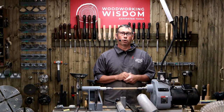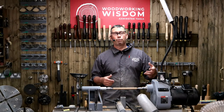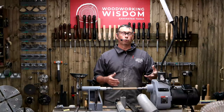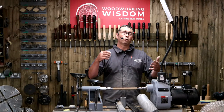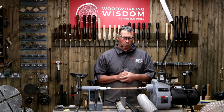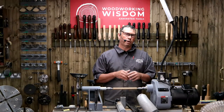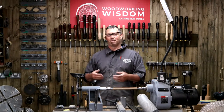You don't have to push hard at all until you start doing big pieces. Then you'll physically have to hold onto the tools harder than you would a smaller piece, because you get more force off the timber. You think about all that force coming down on the chisel. So normal turning, not very hard at all. But like I say, the bigger pieces, then yeah, you need to up your pressure a bit.